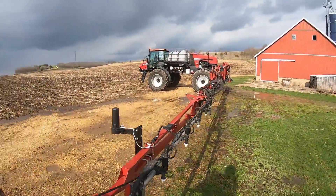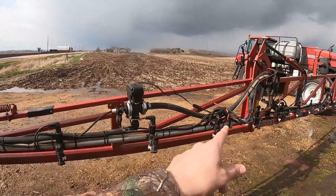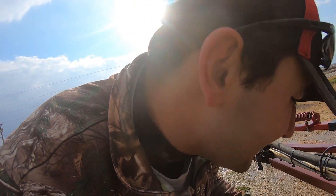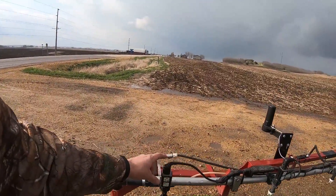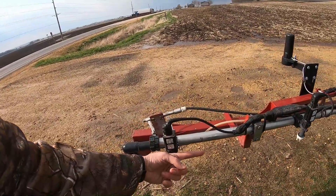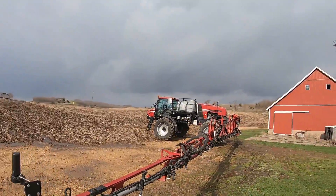This is an awesome system and we will never go back to a regular conventional sprayer. Got a lot of nozzle bodies dripping - I don't like that, it means the seal's going bad. This is my bad tip - it was having a bad pattern. Tried to clean it out, nothing really in there. I could tell because it was sputtering and it wasn't a nice stream coming out. This harness is broken right here - I believe Pat ripped it off last year. You can see the harness sticks up quite a ways where we had a different style nozzle body - the new ones sit down lower so they're not sticking up so high.